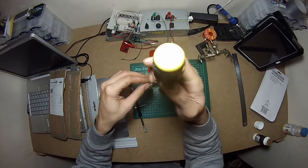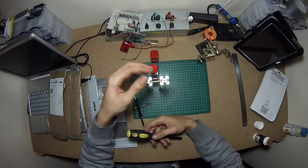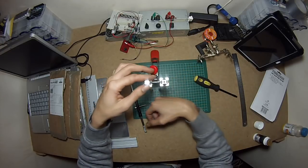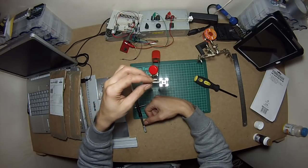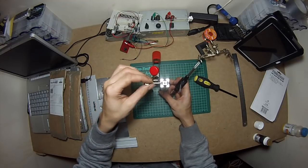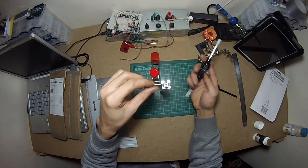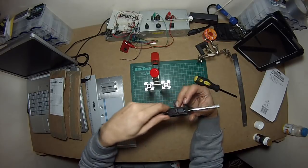I've tapped one of the holes — it's not very hard, it's pretty easy in fact. I didn't know how hard or easy it would be because I've never done it before, but it is pretty easy. It's easy to do but not that easy to explain — just grab your tool and try it, you'll feel it and you'll realise it's easy. To get started, put some oil on the tapping tool to help distribute the heat and protect the tool.